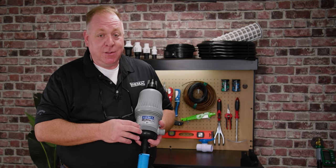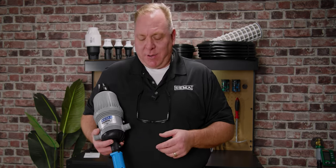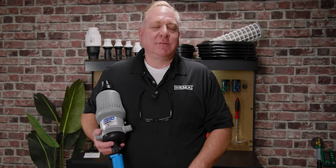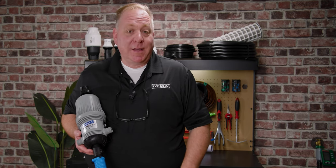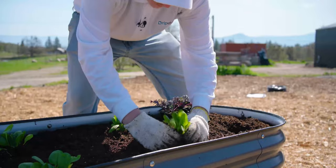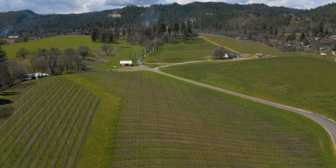It's compact, it's easy to use, and should you need maintenance, it can all be done in the field. The action in the MixRite is powered by your waterline pressure and flow — it doesn't require any electrical sources of any kind, as long as you have water pressure and volume. Our MixRite units are compatible with any of your plumbing materials: polyplastic, PVC, or even copper. It allows for those growing at a hobby farm level all the way up to commercial vineyard and orchard operations.